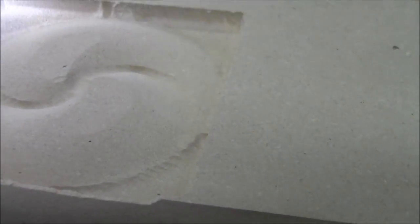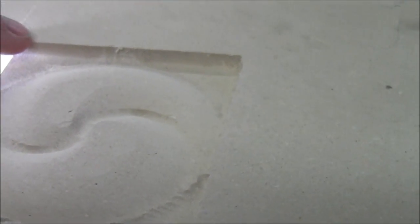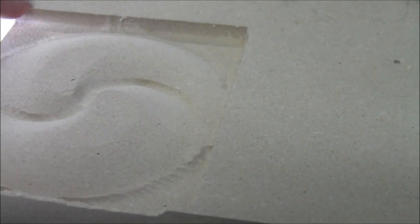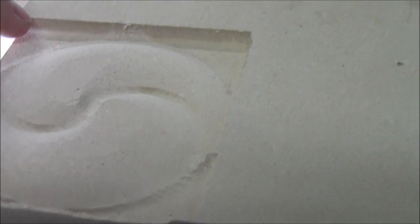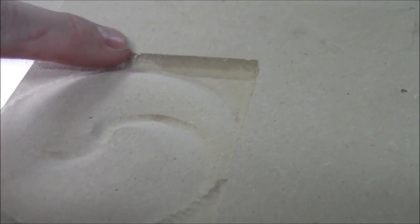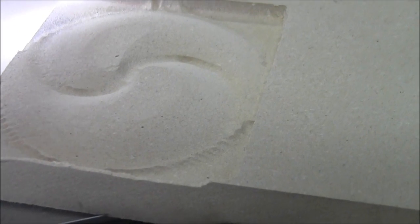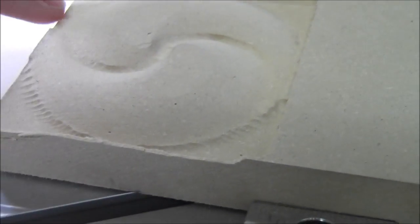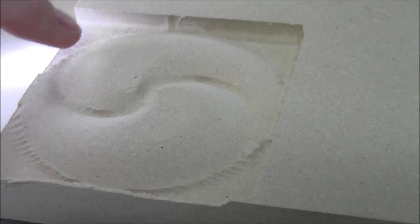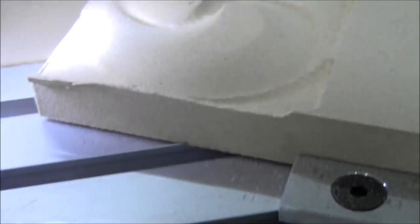So it's probably best if — I don't know how you solve that — but if the roughing tool path went a little bit past to try to go where this... yeah, that's weird. I don't know how you do that mathematically. But this full depth pass is not terribly safe. I know it also does it way over here. So it may need a max depth, because there are going to be some areas where that's just not a safe thing to do.